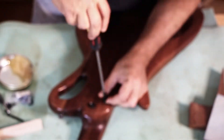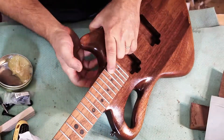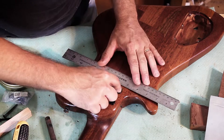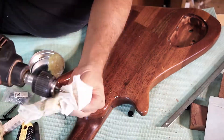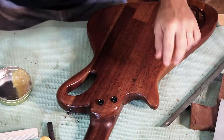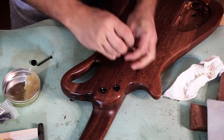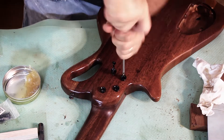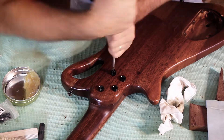The part left in the body side of the connection doesn't have any threading on it, so I could pull them apart after removing the other screws. The other option is to just leave it and drill a second hole right next to it, making sure the washer covers the first hole. Since the position is not exactly parallel to the first screw anyway, it will not make a difference visually. I drill the second hole and this time use a bit of beeswax on the tip. It's a tight fit and I manually screw it all the way. The other two holes are drilled and screwed with no further hiccups. The lesson here is simple: if you don't have a more sensitive power tool, just hand screw it. And don't forget the wax — it makes a huge difference. This is even more true if you have screws of the cheaper kind.